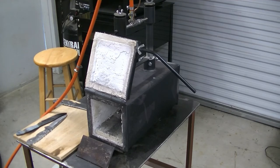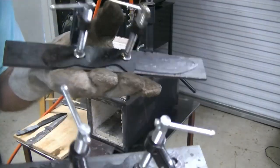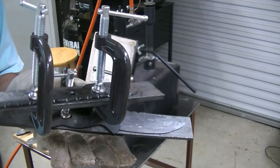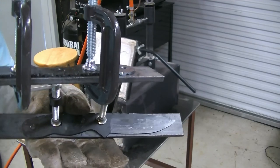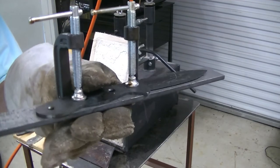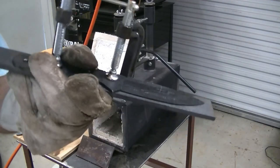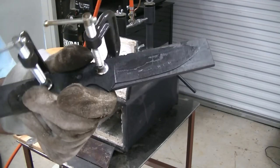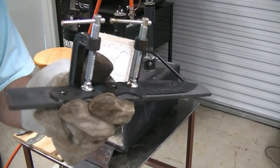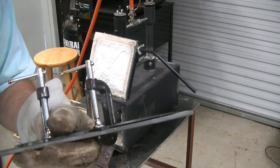Once I got the fire off and got the oil off of the blades, I have clamped both of these knives that we just quenched into a straight piece of mild steel, and that is to keep them from warping during the tempering process. All you do is just lay your knife on the flat piece of steel, clamp it down in a couple places, and that should keep it from warping. When I looked down this blade a few minutes ago, I saw that it had a curve or a warp to the left, so I laid that side down and clamped it out straight. When this goes through the tempering process in our oven, it should take that warp out of there. So with that, let's go to the oven.